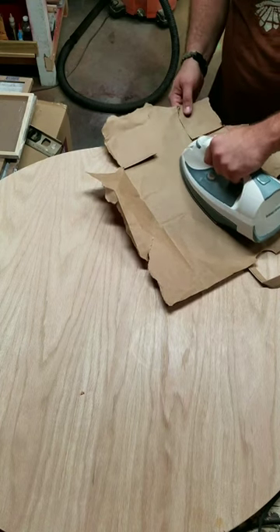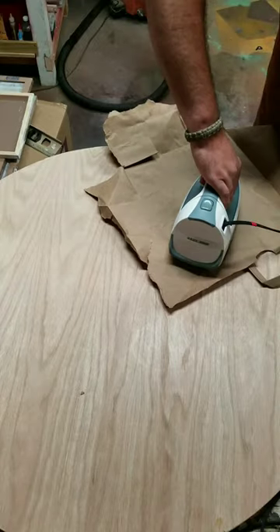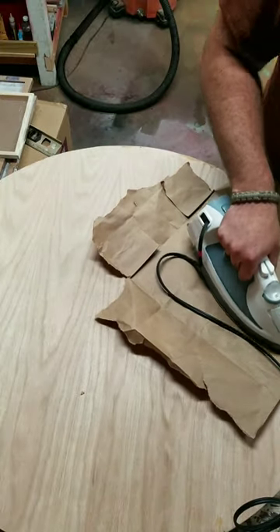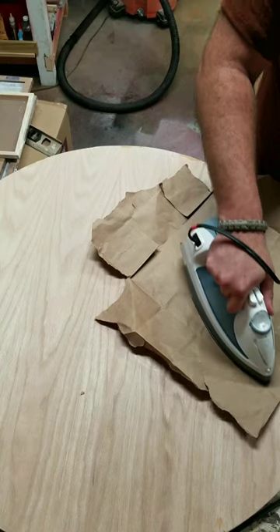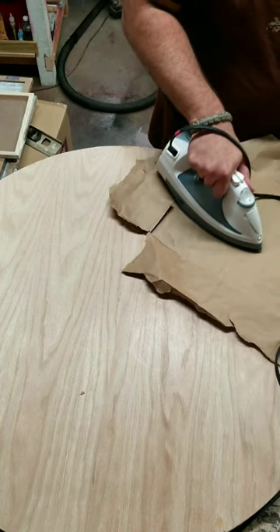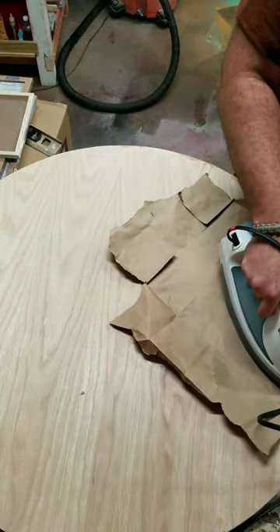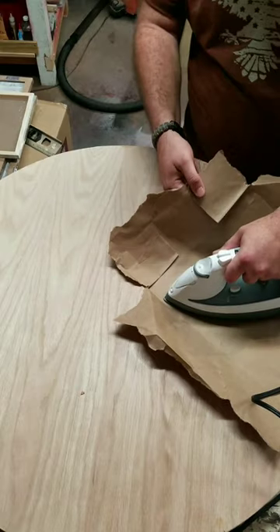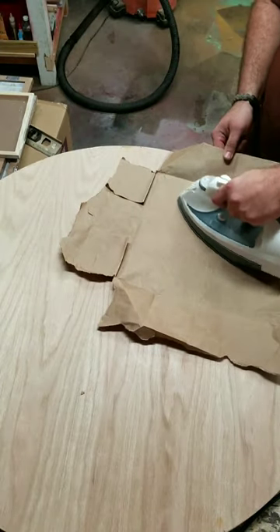See if I can lower them and get them flat. This is the path of least resistance when you're trying to get bubbles out, and you'd normally use this method on regular veneer as well. I was using the peel and stick stuff, which just has an automatic adhesive — you peel the sticker off and flatten it out with a roller or a block of wood. Every other fixture worked great, but this one, I don't know if it responded to humidity. You'll see that with seasonal changes as well — wood can have a funny way of showing itself in different fashions, and that includes veneer, especially when it's so thin.